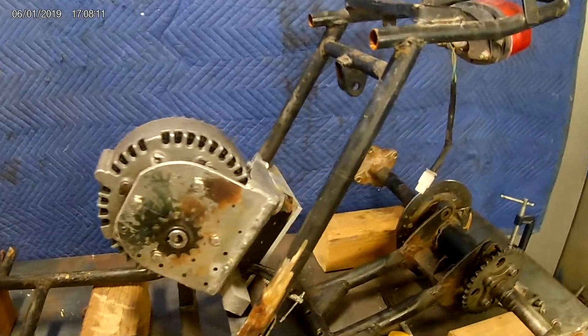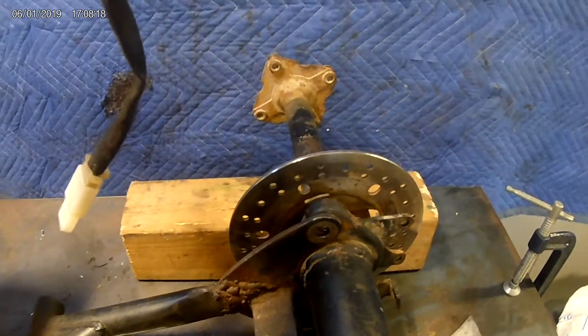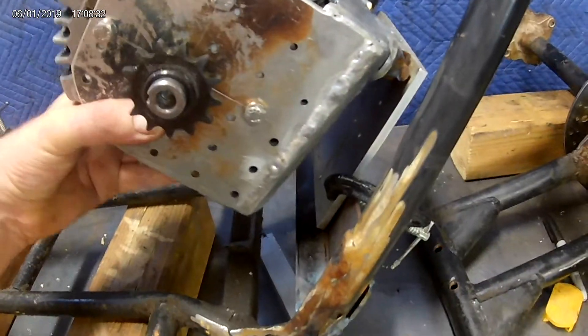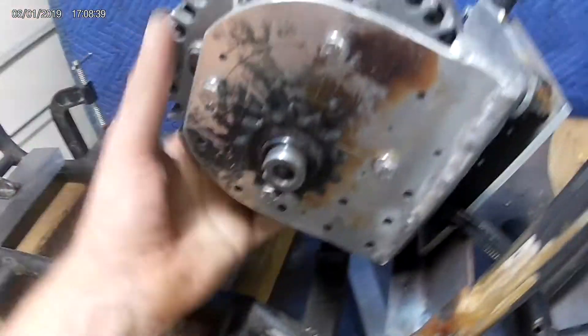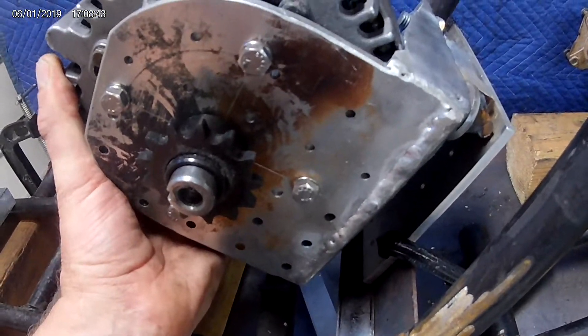What I want to do is have the brakes work on this machine, but of course nobody's in the cab to operate the pedal, so I needed some way of putting the brakes on. So I've mounted the motor here on a pivot — I've made up this pivot plate here and the motor will pivot. I'm hoping that when it's being torqued on this side of the sprocket, it's going to want to pull the motor up, and there'll be stops and springs to kind of bias it there.